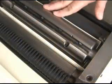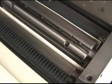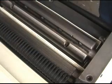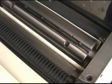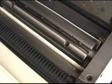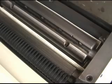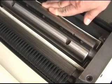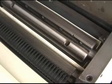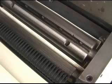The cutter and roller assembly is very much like you'd find on any machine. We start with a row of gravity-operated anti-kickback fingers that keep the material in place should it fracture or something else go wrong under the cutter head. Next is a serrated feed roller that keeps the material moving at a constant 20 feet per minute rate. Next is the cutter head itself with its 3 long knives. Finally is the rubber-covered outfeed roller that moves the material out of the machine without marring the freshly planed surface.